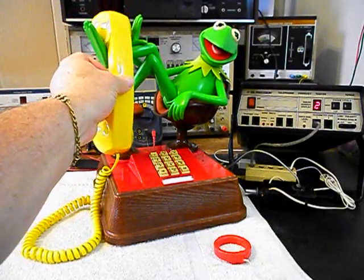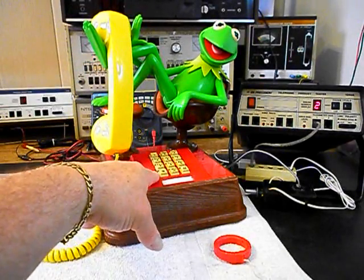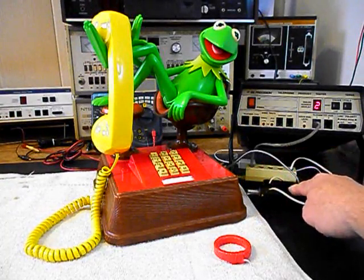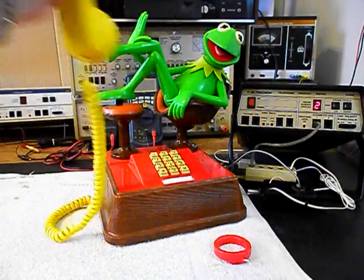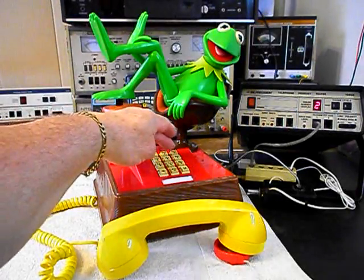So now that we know that this unit is ringing in on a ring cycle, it's dialing out, and we have transmit and receive — we can push this button on the switch box. That gives us a line out, totally takes the analyzer out of the situation. We can call a time and temp number, so we'll go ahead and give you some dial tone and make that call.